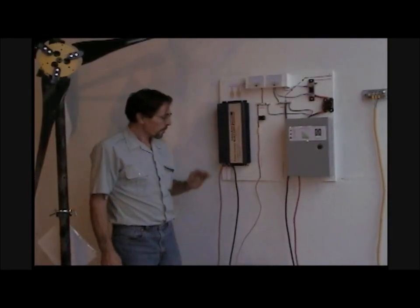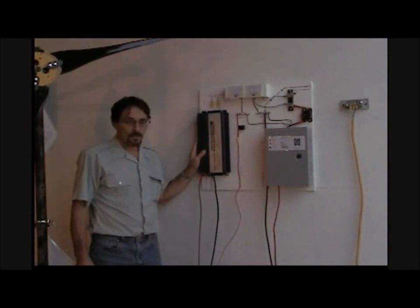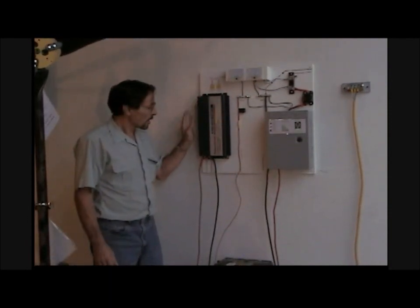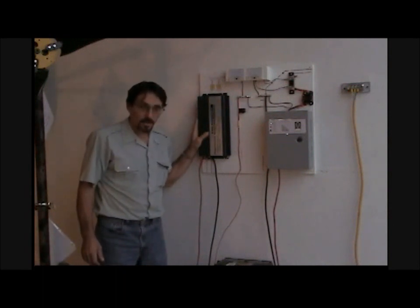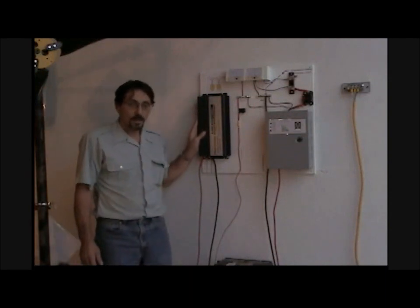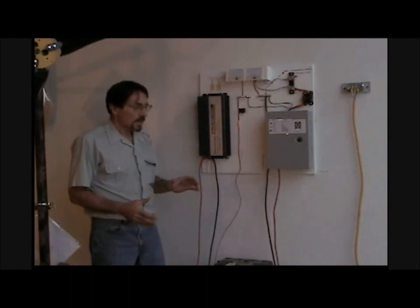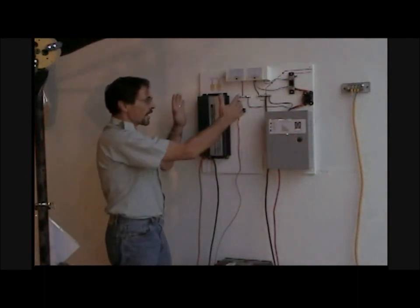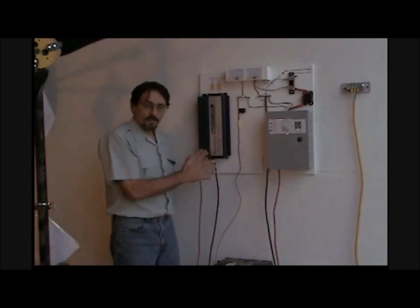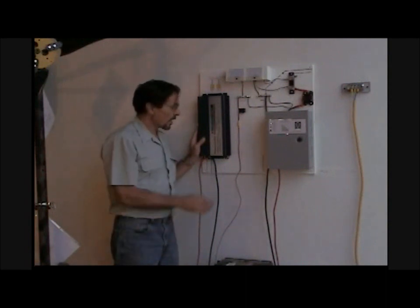A question people ask me all the time: how can I wire this into my fuse box to feed electricity through my house? Well, you can't wire this into your fuse box, and you can't put a cord from this and plug it into a house outlet — if you do, this inverter will just explode and catch on fire, and you'll get electrocuted. You cannot hook a cord into the front of this and plug it into a house outlet. That's what a grid tie inverter is for. A grid tie inverter mounts next to your fuse box and is wired into it, and then your wind turbines or solar panels go into the grid tie inverter. They're really nice but usually require an electrician to wire them in. You have to basically plug into the top of this inverter to get your power.